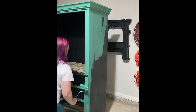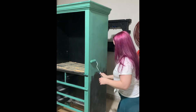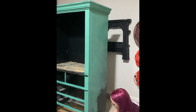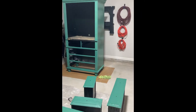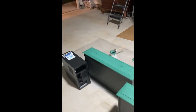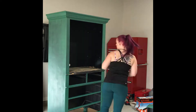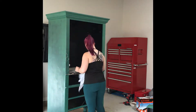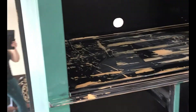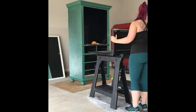As you can see, while we did sand down the main body and the drawer fronts, we did not prime, and I wish we had. You'll also see all this wood filler in the big shelf in the center there. There were a few more gouges and cuts than we had originally seen when we bought the piece, so I filled that in to hopefully mitigate some of that damage. I didn't sand the shelf and get the gloss off, and that was a mistake.